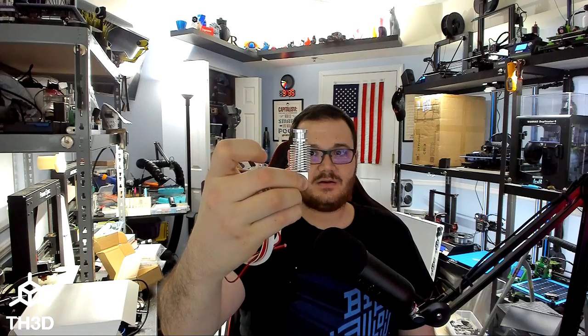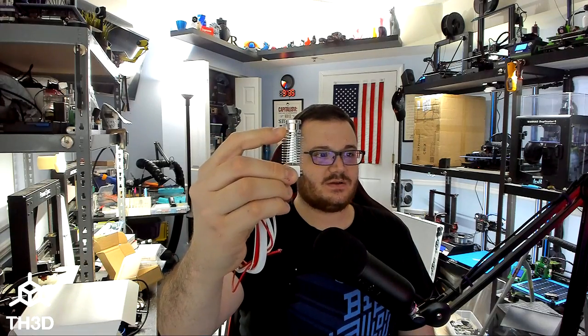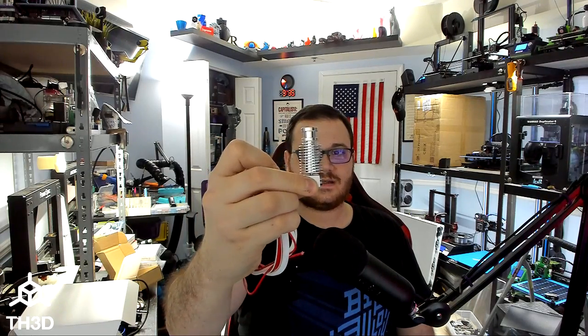These fans run all the time in conditions that are not ideal, meaning higher ambient temperatures — that's why I select the fans I do. Now, the Noctua fan problem isn't just airflow. The Prusa machines come with Noctua fans on their new ones, but notice this hotend has stacks of fins and a lot of surface area — similar to what a Prusa uses. This is what's getting cooled by that fan, and that large surface area means you don't need as many CFMs to keep it at a good temperature.